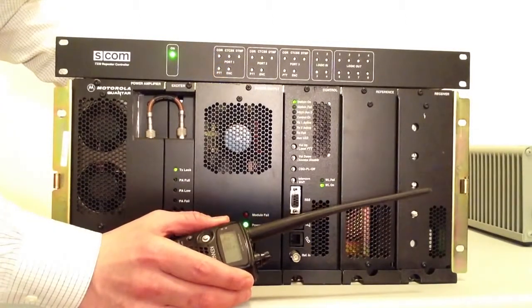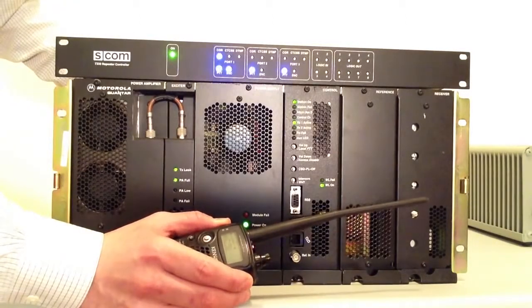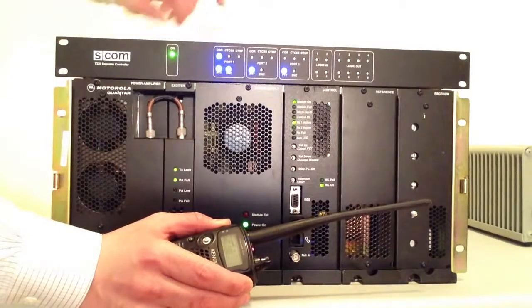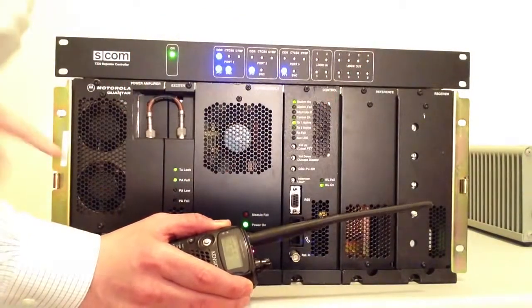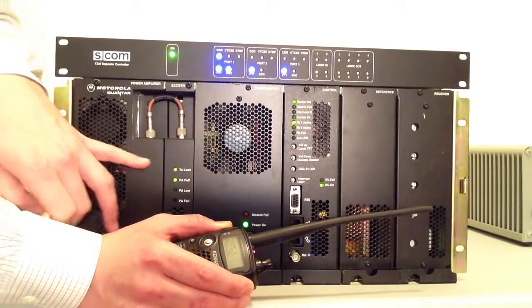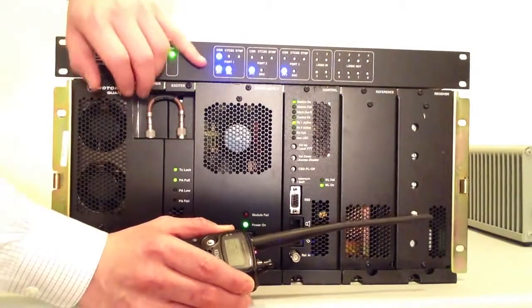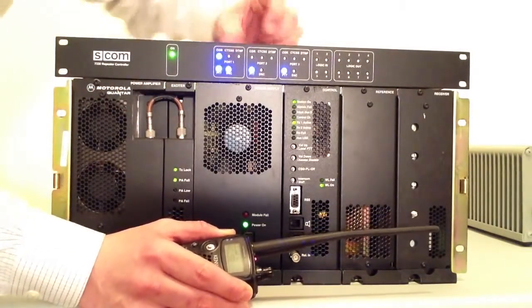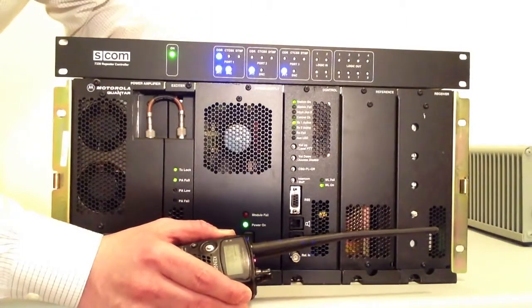Now, one thing I want you to notice, and this is important for the people who want to use Echolink or an IRLP node, I'm going to transmit. You can see we have our receive 1, we have our PA full power. In this case, it's only 50 watts because I've turned it down, I've derated it. But as I release this push to talk button, the encode light is going to go away as the PTT remains on for the hang time.